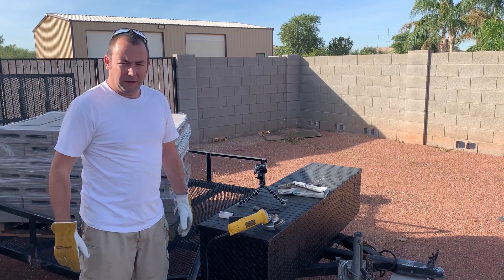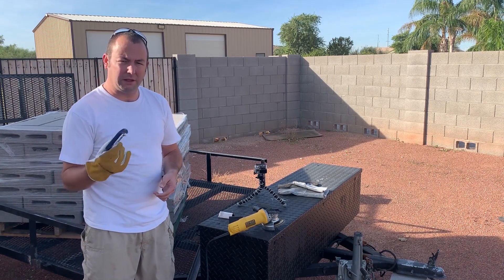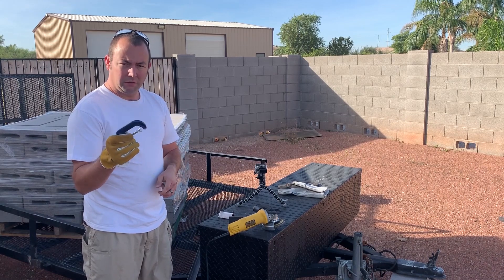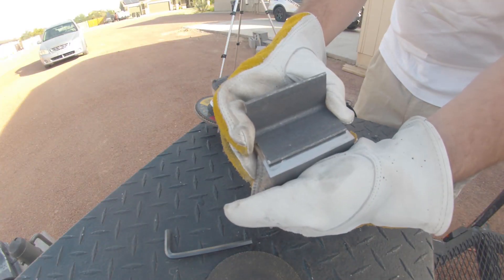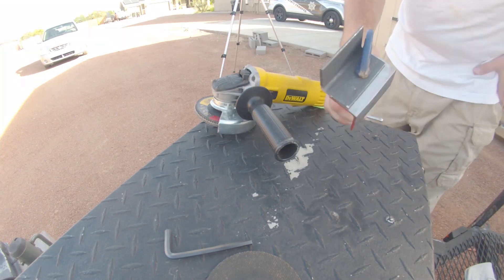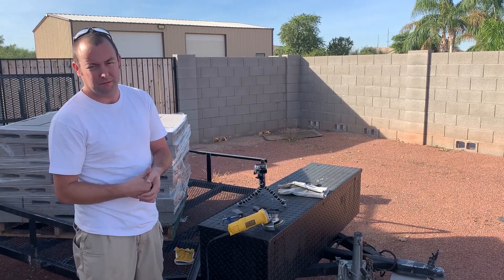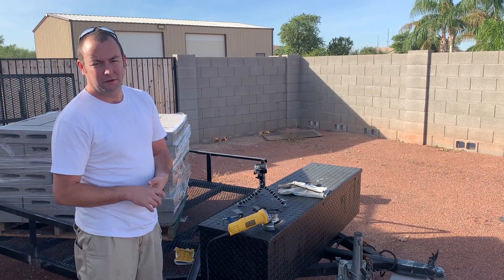Now that we've got those pieces cleaned up, it's time to clamp them together and start welding. It's important to keep things clamped because it'll keep them nice and tight as you start to weld, won't allow them to move around, and will make a better bond once complete. This is just a small clamp I got at Lowe's — it's also down in the description. Now that we've got the pieces cleaned, we're going to clamp them together and make sure they're nice and tight so it creates a good bond. As I say in a lot of these videos, preparation is the key — the actual welding only takes a few seconds, but cleaning, prepping, and clamping takes a lot longer, but it helps everything turn out a lot better.